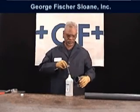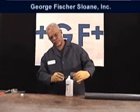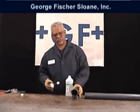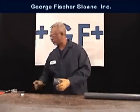The materials to be joined should be clean of dirt and debris. The joining surfaces must be cleaned with alcohol or pipe cleaning solvent. This is easily accomplished using an applicator and clean rag.